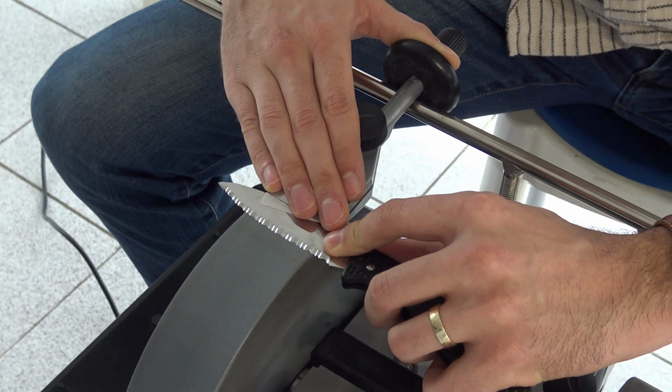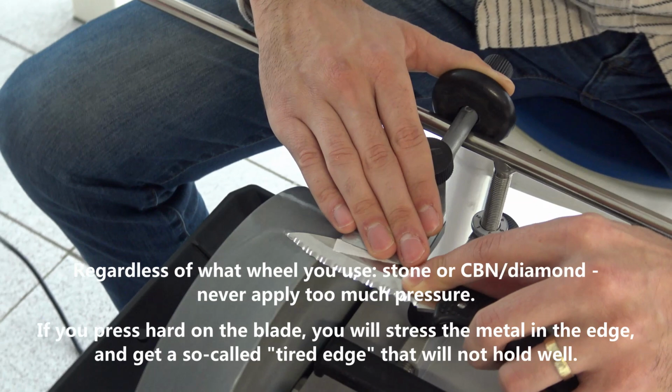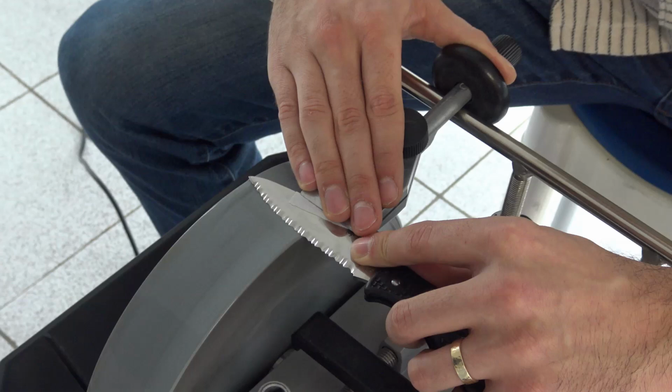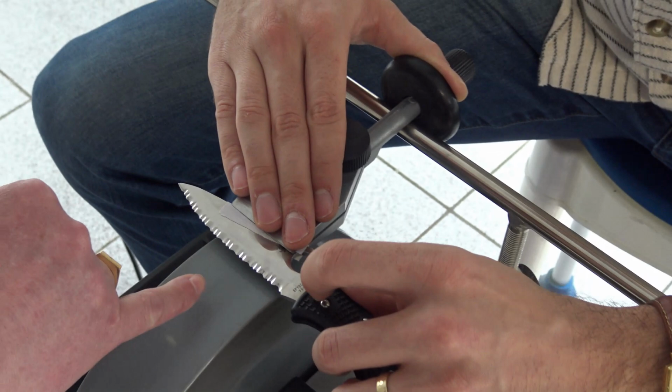Does it matter how much pressure I apply down? Should I be pushing medium or softly? We never should press hard. This is the general rule. Maintain the stop flat against it. Leave the handle to do the tip. Don't stay in one spot. Keep dragging all the time. As soon as the tip goes to the middle of the wheel, raise the blade and start from the beginning.